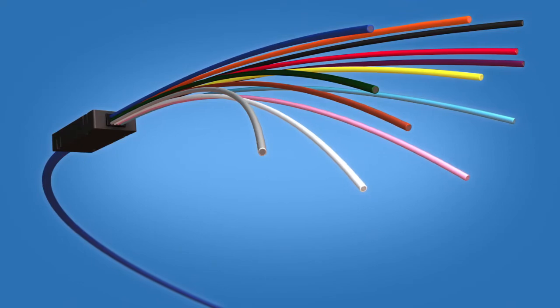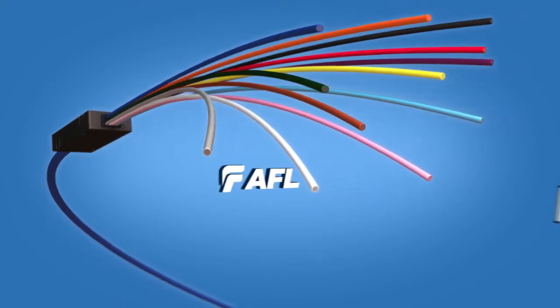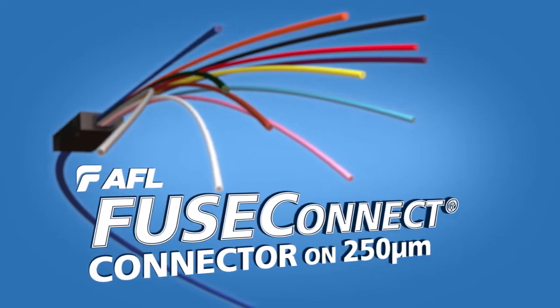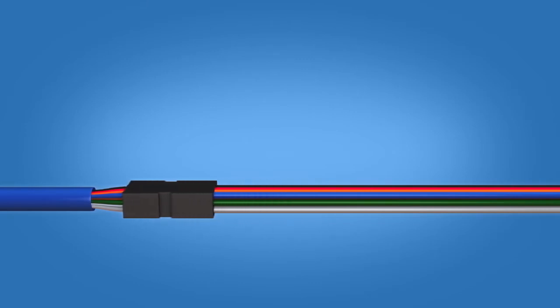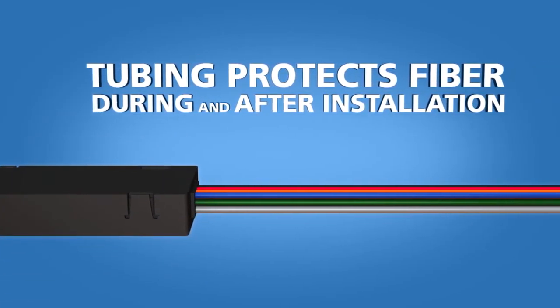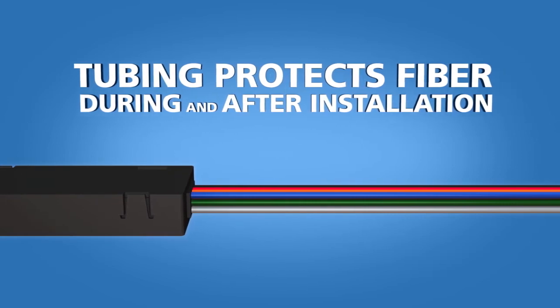This installation video is applicable for splicing AFL's FUSEConnect connectors onto 250 micron fiber. When terminating 250 micron fiber with FUSEConnect connectors, the fiber must be inserted into a 900 micron furcation tube before termination. This tube is required for appropriate protection of the fiber during and after installation.